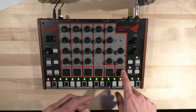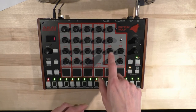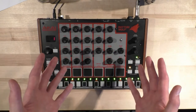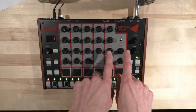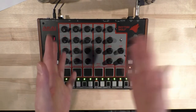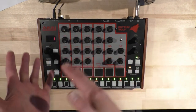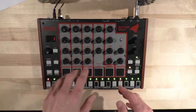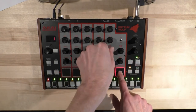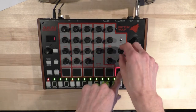The other thing I did is change the filter cutoff to be exponentially controlled rather than linearly controlled, so it actually has a much wider range. For both the filter cutoff and resonance, I've adjusted their full ranges to have a whole bunch of resonance and also to bring the cutoff filter all the way down super low. You can actually go subaudible with it, which makes it kind of weird. It has a much larger range.